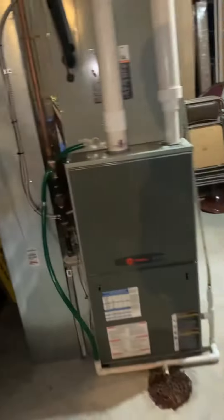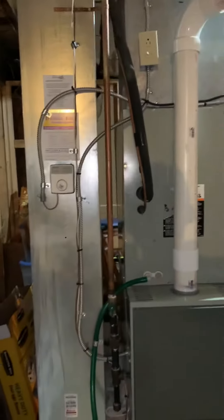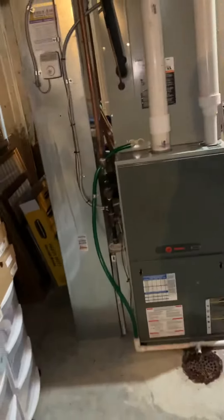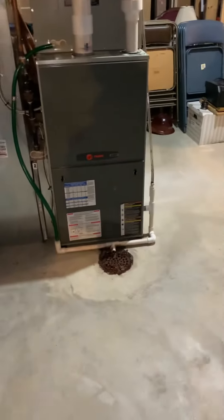And return duct — got a pretty open basement. Had to get a couple things moved back here and do some modifications. We want to look at possibly flaring the supply plenum, look at getting the humidifier more on the return if possible, which we do have the room here to do. We may even go with just a bigger front portion to put it on the front, then connect in and get our five-inch filter base, new drains, and catch the floor drain on this one.